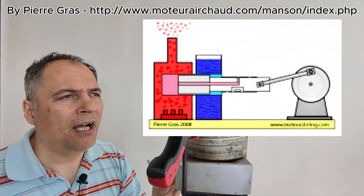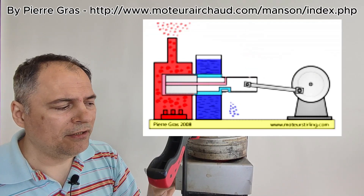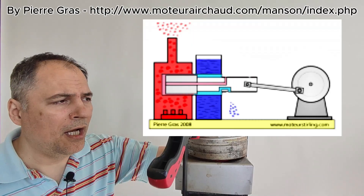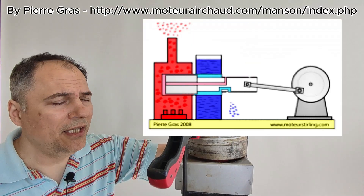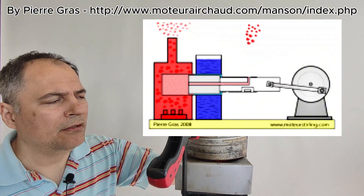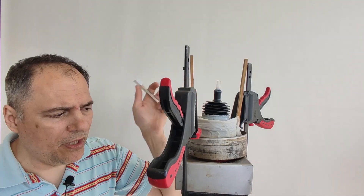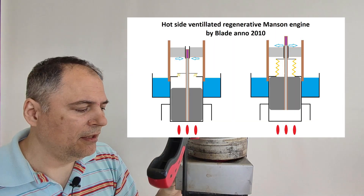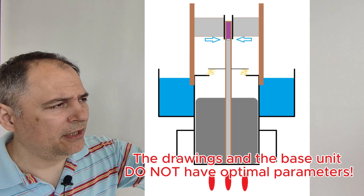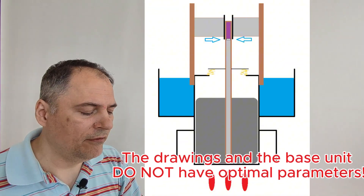The original unit has hot side ventilation and cold side ventilation. The hot side ventilation is only open when the power piston is on the upper end, so pressure is released from the hot side, and on the negative cycle, when pressure normalizes, the cold side opens. My version is only a hot-side ventilated version, because my original has a regenerator in the tube all in the unit, and the displacer is regenerated also.